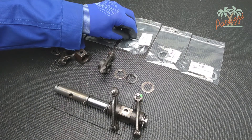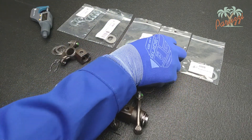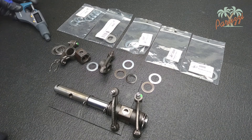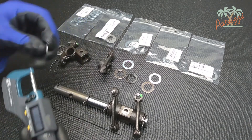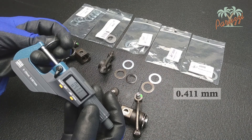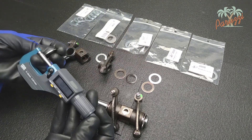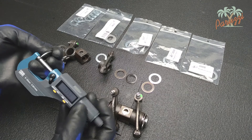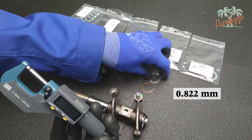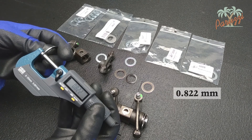The total of the two flat washers is 1.97 millimeters. We take two shims of 0.762mm and one shim of 0.381mm as discussed earlier. We now measure the thin 0.381mm shim with the micrometer — the actual value is 0.411mm. Next we measure the two thicker shims of 0.762mm which will replace the original flat washers. The actual value of the first shim is 0.822mm, and the second shim is also 0.822mm thick.